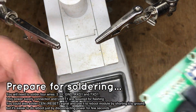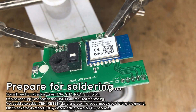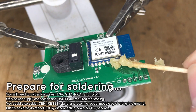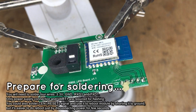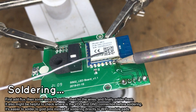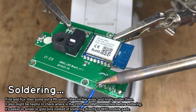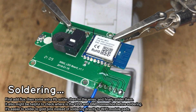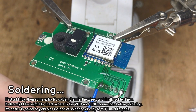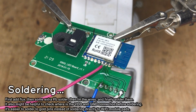In order to flash new firmware, you need to solder ground, power, and UART lines — RX and TX. First, add some flux on the pads, then add some extra solder. Without adding extra solder to the pads, you wouldn't be able to easily solder the wires. Then tin your wires and finally solder the wires to the pads. Hold the wire with one hand and the soldering iron with the other. Do not move the wire away before the solder solidifies. All four wires are now soldered.